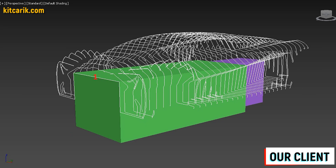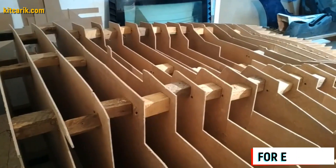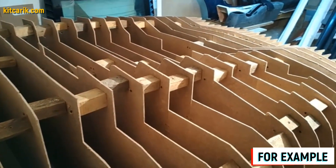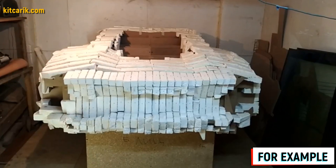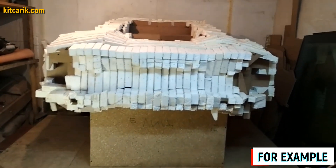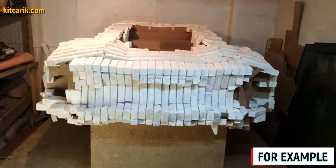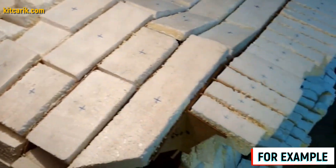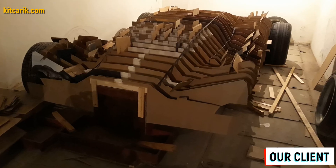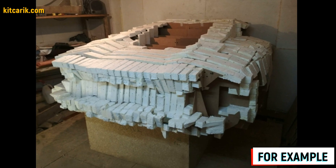Car buck assembled — like Lego, but for men. Next we need to foam and putty the car buck for further work with fiberglass molds and bodies. We fill the space between sections with styrofoam, which is more economical than liquid foam. We cut styrofoam pieces with a width of nine and a half centimeters and four and a half centimeters, and glue the foam just above the level of the sections. To avoid confusion about what's been glued, we can mark the foam with a marker. After the foam dries, the excess foam is cut away along the ribs of the car buck sections.